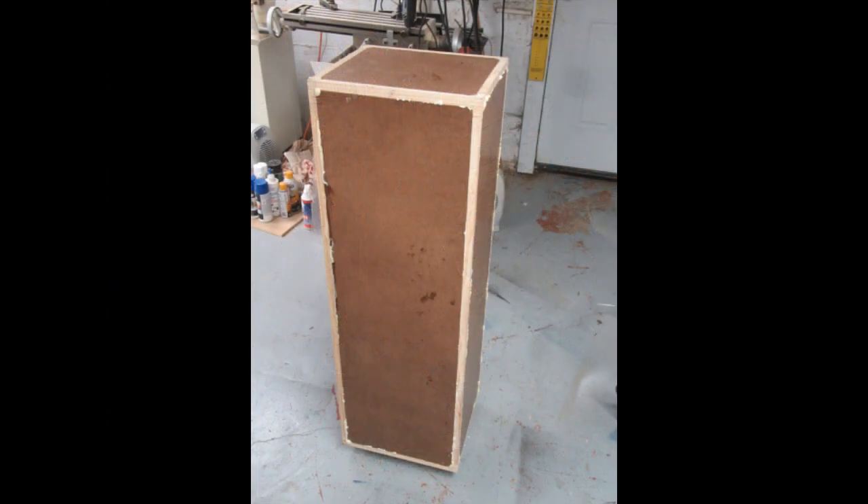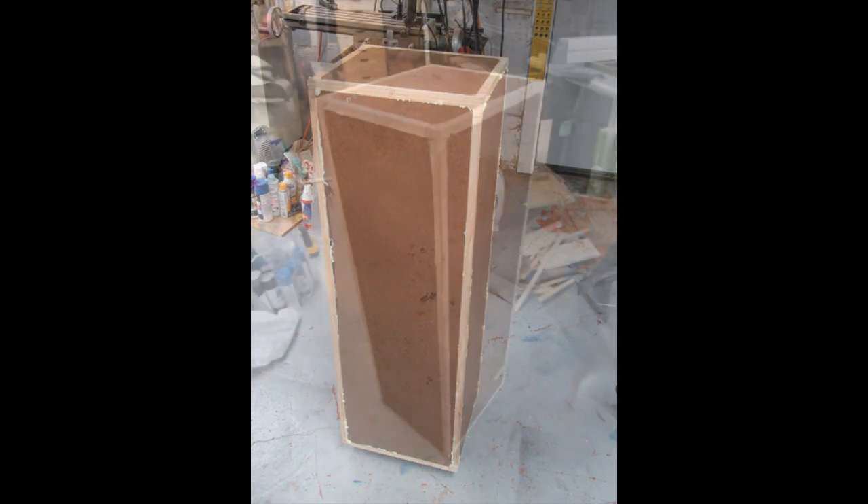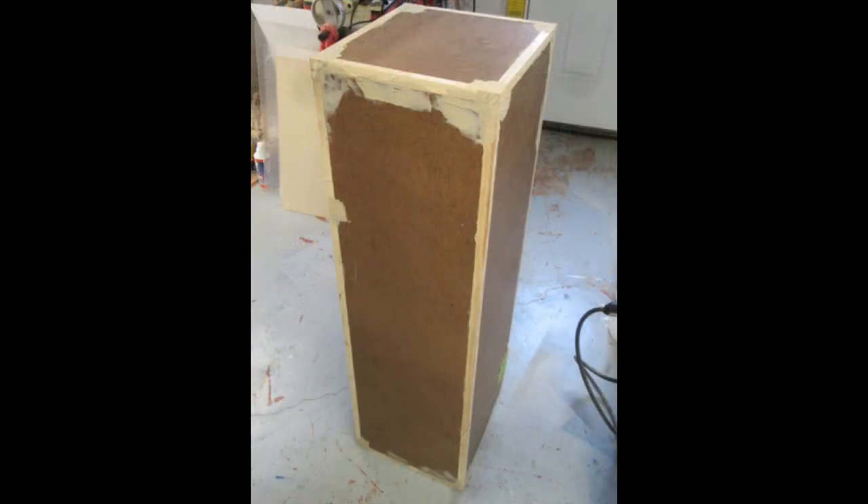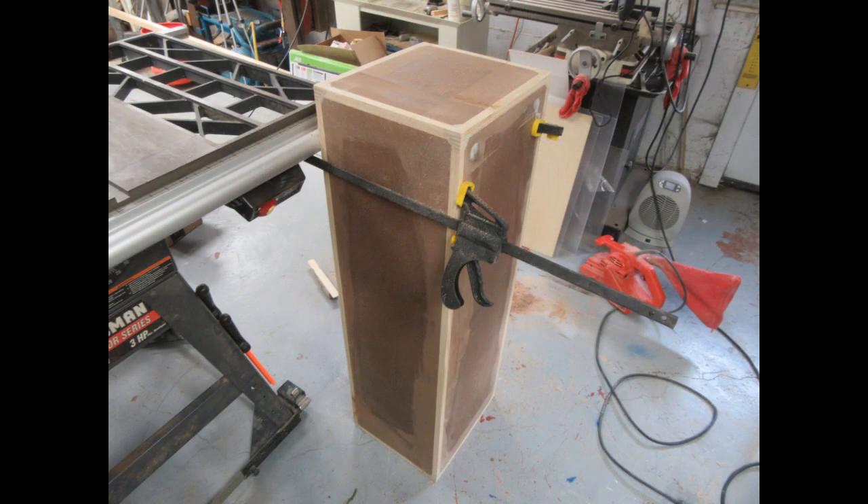Here's the box with all the sides glued on and the Gorilla Glue foams out of the seams — I use a chisel to scrape that down. I apply epoxy wood filler to all the seams, not the kind that's just sawdust mixed with wood glue. I apply that to all the seams and then sand the case down, which removes excess wood filler and brings the level of the frame down to match the masonite. You can see the red colored handheld belt sander I use for that process.